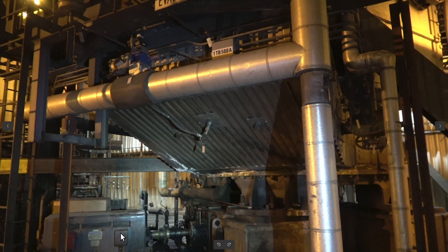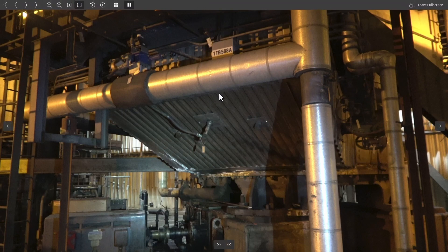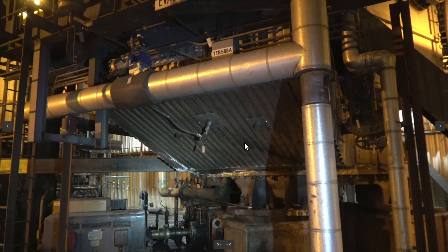This shows the motor down below. Down here you have the oil pumps for the gearbox oil — it runs through filters and coolers. There's a sweeping steam valve going in here and a temperature probe for the air coming into the pulverizer. The PASO sits up here with the flow control and guillotine. So this is the air coming in, and the outlet temperature determines what this inlet temperature needs to be.